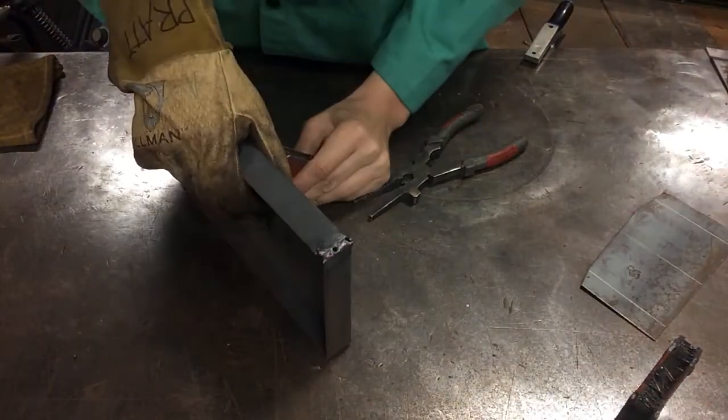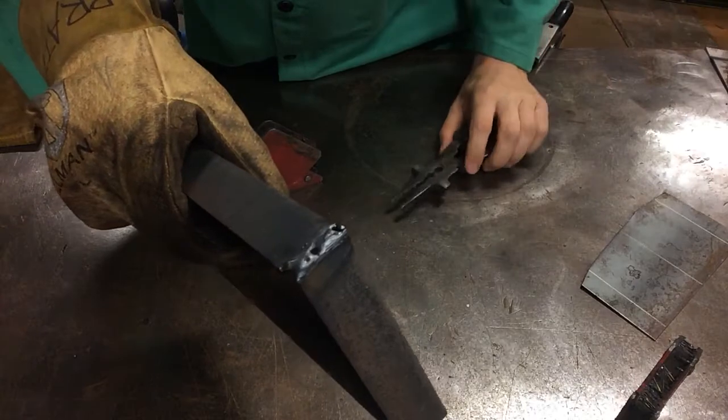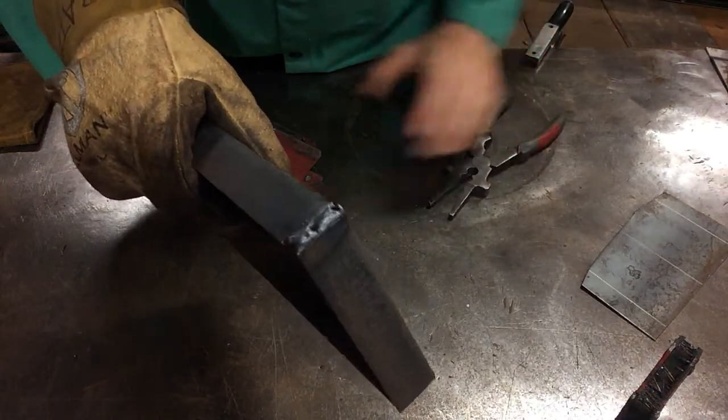The difference here is I had to move a little faster. You'll notice there is a pinhole gap here as well as here, which means I'm going to have to come back in with the welder and do small pulse welds to fill those gaps.